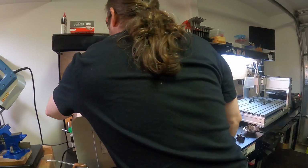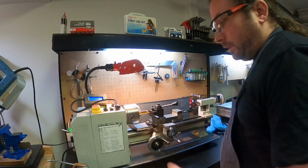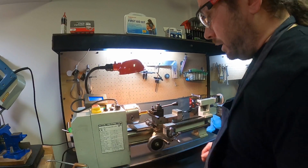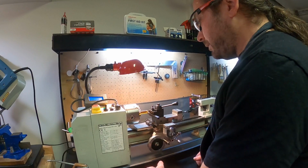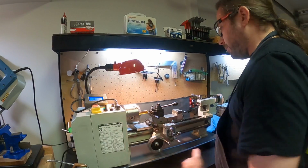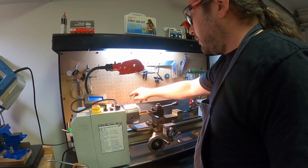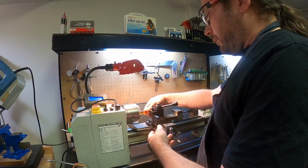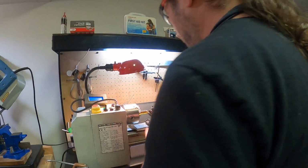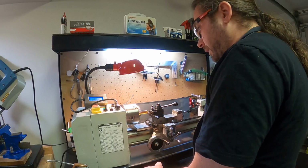You can also polish the surface of a part that you've machined. You can polish that surface in the same manner on your mini lathe. You've got to make sure that you are careful about cleanup on your ways, because you don't want any of the fine grain sand to get on there. As you are using this stuff, some oil with the grit will fly off. So you've got to cover your ways, and then after it's all over, clean the whole thing real good. But you can do some light surfacing like that.